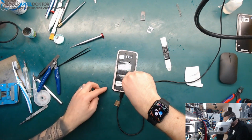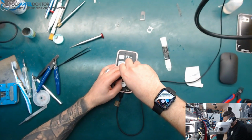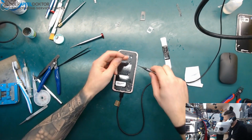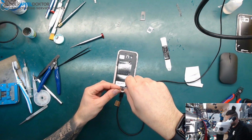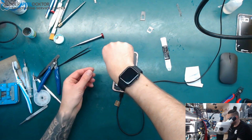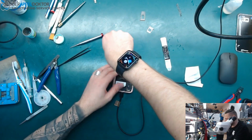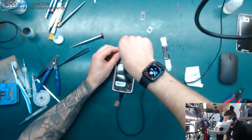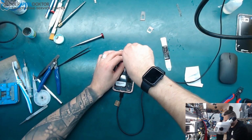After that I completely clean the frame, completely clean the back cover, put a new adhesive on it and get it down. I use original Samsung adhesive. I don't use glue like B7000 or T7000. We always use here in the company new glue sticks, original Samsung, for getting the phones back assembled together. So, all the screws in.